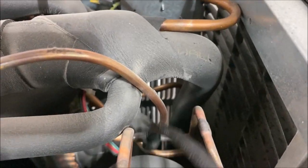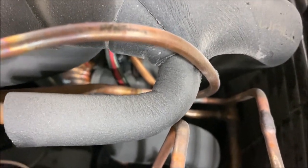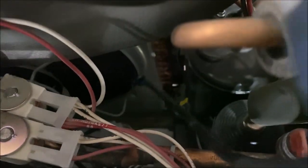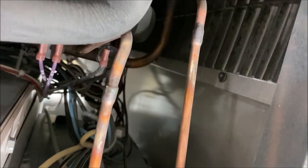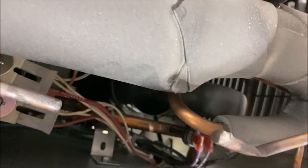There are a lot of brazed joints in this machine, and a lot of Armaflex insulation that may need to be taken off. Let's go through all the usual suspects and take our time — hopefully we get lucky and find a hit. The fact that it's empty tells me it's a good-sized leak, but it's hard to say since the unit is over a year old — it may have been leaking slowly over time. Another company came out and determined there was no refrigerant in it, but whether they did a leak test I'm not sure. We're looking at the entire piping section for the condensing unit — there are two TXVs and a lot of gas valves. There's a lot going on here for a leak test.